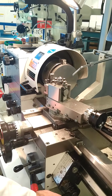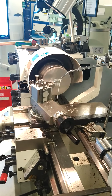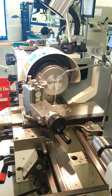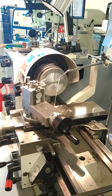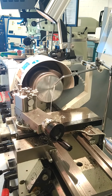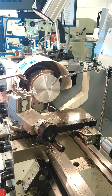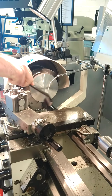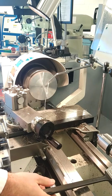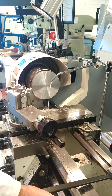Powering on the lathe for the first time, and now we're going to face across the piece out to the centre. So now they're out of the centre, you're removing the brush, and I said don't ever attempt to put your hand in there. It's always using the brush to feel where the chips are, or using a swarf hook to catch the chips and see if they're continuous chips.